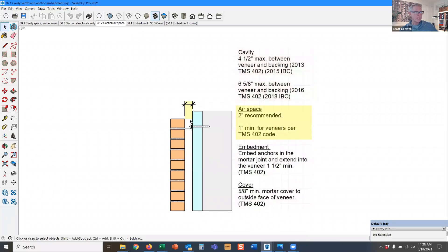And now there's a different way to measure, and that is from the face of the insulation to the cavity side of the brick. This is for moisture. So the bigger number is better here because if this number gets too small, it becomes difficult to maintain a drainage cavity that will function effectively. This is one inch minimum, but really two inches is recommended.